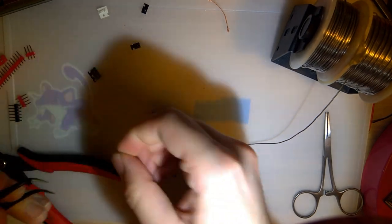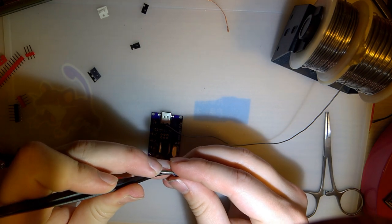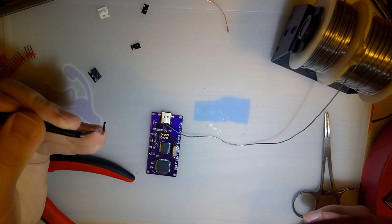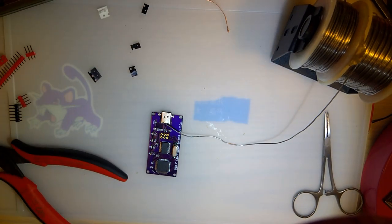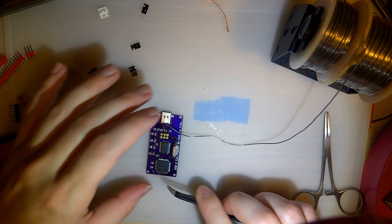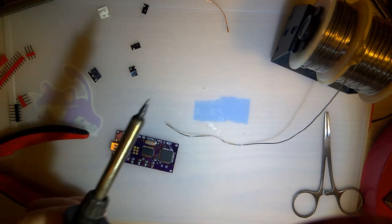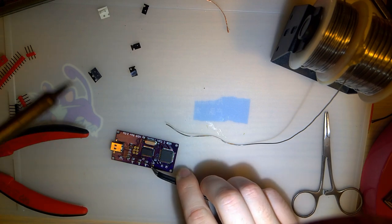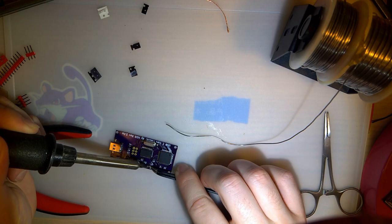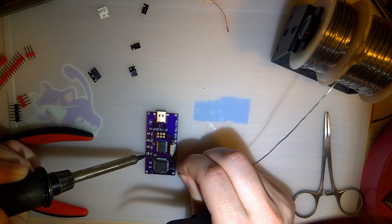So, if you were to try soldering down parts that have absorbed water, usually you would solder these in an oven or something. What would happen is the water will boil and vaporize, and it'll pop out and start moving components around as it pops out, which, as you can imagine, is probably not very good.